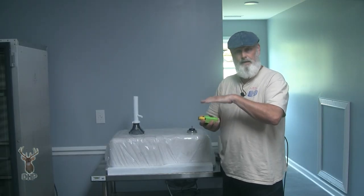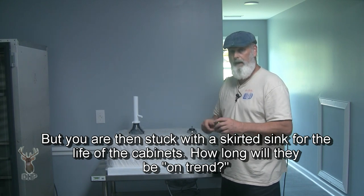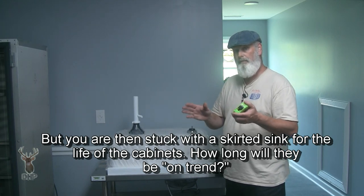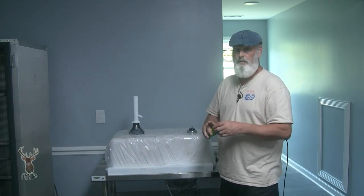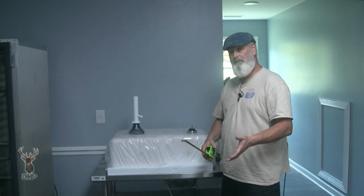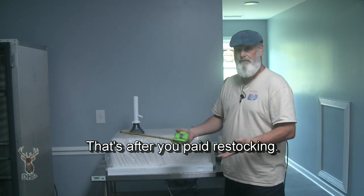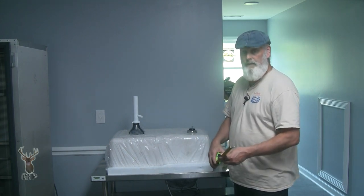A common way people deal with that is to put a shallow farmhouse-type skirted sink in an existing cabinet where they can cut out that upper blank. But if you have full-lap doors versus half-lap doors, you may be in a tighter situation. You need to check those dimensions carefully before buying a sink. If you order something that doesn't work — especially a special order — some places charge a 20% restocking fee, then discount and resell that sink.